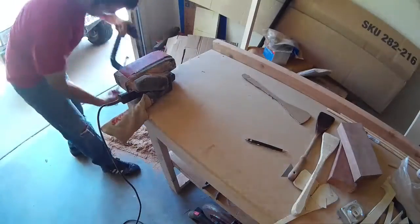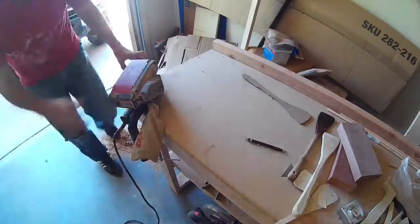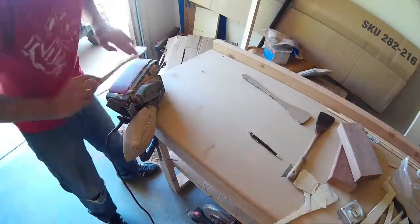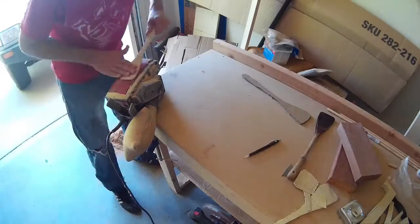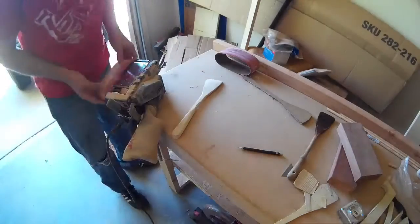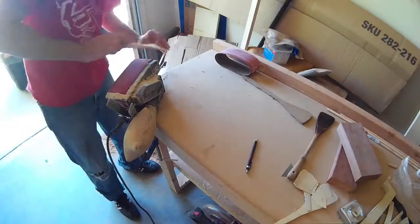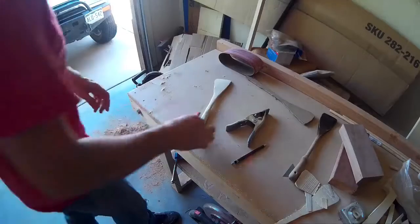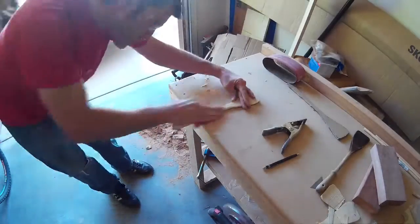Once all that was done I still needed to finish shaping it and final sand it. So I took the handheld belt sander — one that has a lock on the trigger — and I used clamps to put it in a jig and hold it tight. Then I turned on the trigger with the lock so it would keep going while I had it upside down. I started roughing it out with 80 grit, and now you see me doing it with 120 grit. Keep in mind this is sped up 2000 times, so what you're seeing in around 6 minutes took me a better part of 40 minutes.